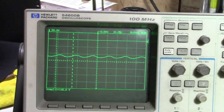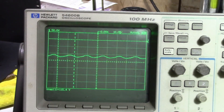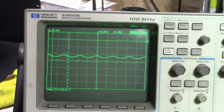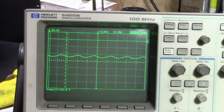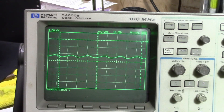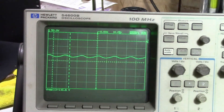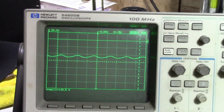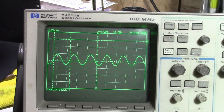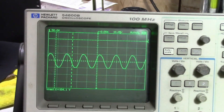That's another factor that plays into this. The more voltage you have on the plate, the more negative the grid needs to be to hold electrons back. So that's why when I've got this voltage control at 0, the output voltage is at 0 — this needs to go more negative. There's a bit of AC on that because we've got AC on the grid and AC on the plate, and DC on the cathode. Unless I want to redesign the circuit and go tinkering with it, that's how it's going to be.